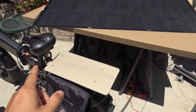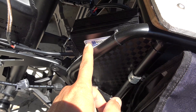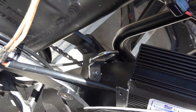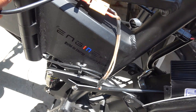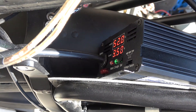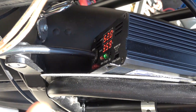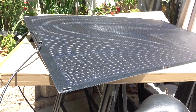Next, I'll plug in my e-bike. On this bike I have an Eco-Worthy boost solar charge controller, which takes 38 volts from the solar panel and puts out 55 volts to charge the bike. With the solar panel connected, the controller outputs 57.6 volts. After plugging in the charger, we get 52 volts output at 3.5 amps — that's about 182 watts, which is more than the EcoFlow result because this controller is more efficient. At 184 watts, that is very close to the rated output of the solar panel.